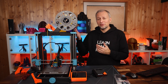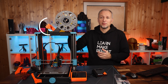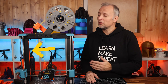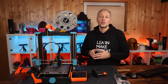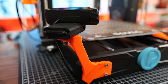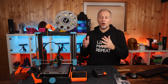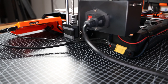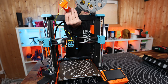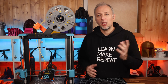Coming back to my original plan of adding a filament sensor: I decided not to have it sitting on top of the extruder, but fixed it to the top of the frame next to the filament spool using a custom mount I designed specifically for this printer. The cable runs nicely inside the printer frame, fixed using two more V-rail covers. To monitor my prints, I'm using a Logitech C920 camera attached to the front of the printer frame using a printable mount. For keeping all the tools easily accessible there's a toolbox on top of the power supply. Finally, I organized all cables and attached them to the printer frame using existing clamps or zip ties — so you can unplug the power cable and carry the printer around with no cables hanging, except one cable I added later to connect the BTT Pi to my camera for high-quality timelapse videos.